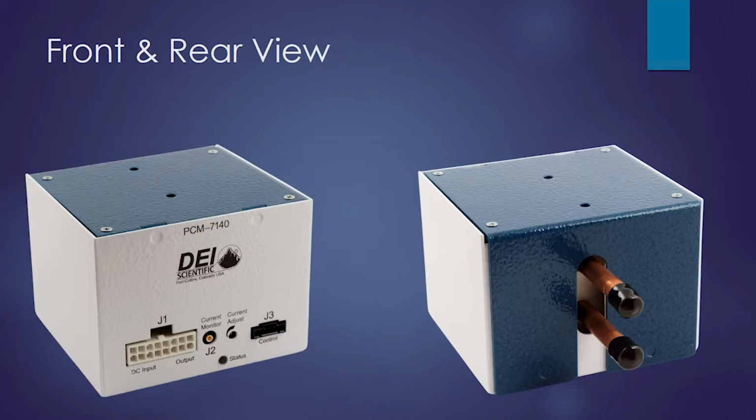Here you see the front and rear view of the module. On the left-hand side you see J1. That's where you put in the high voltage input and the DC output. And J3 is the control cable, and J2 is the current monitor. And if you look to the right of the current monitor, we have a potentiometer that you can adjust the output current and a status LED. On the right hand side you can see the liquid connections.